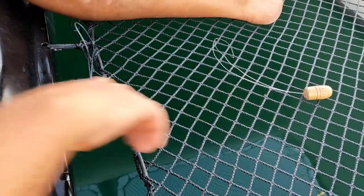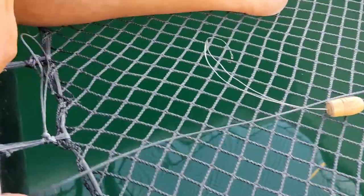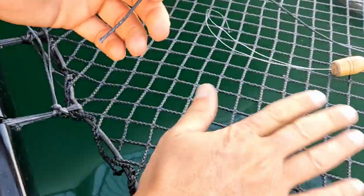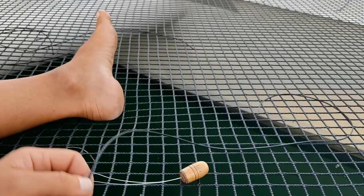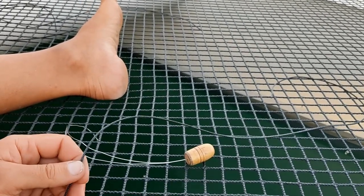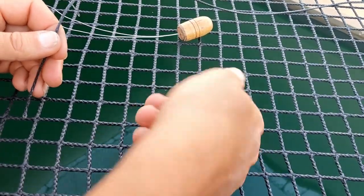But yeah, SK78, 2.5mm. Because it's quite a strong net, isn't it? It's not your average. Yeah, well this is fisherman's net. This net's Dynex as well. It's not polyester like your usual nets. So this is the same material as your low stretch, high performance halyards and things like that.